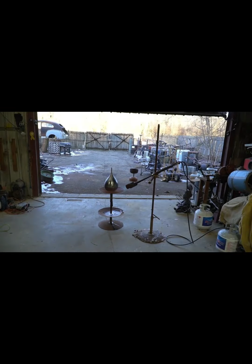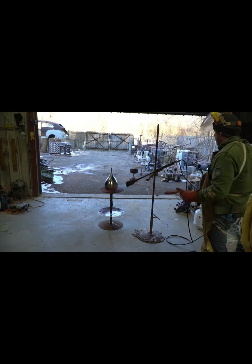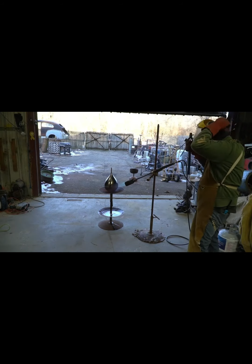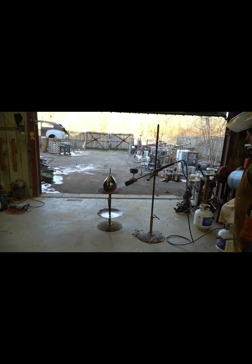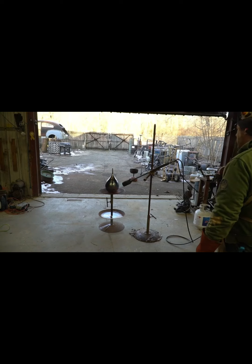Here I'm heat firing it, bring it up. Usually I bring everything up to a super red hot heat so I've got an even mill scale. As soon as this started and I saw the heat colors travel, I decided to try to capture the heat colors with the spray lacquer I've got. I don't know if it'll hold long-term protected or not. Gonna find out.